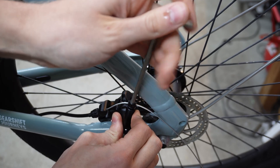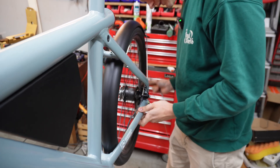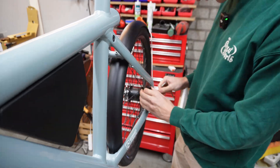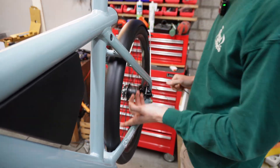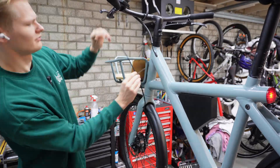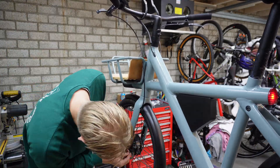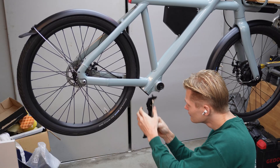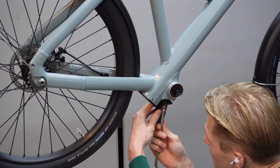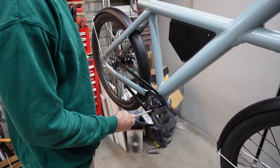With the inner cable wired up to the caliper I can start adjusting everything. These are mechanical brakes, so they're not that difficult to adjust — you just need to try it a couple of times and get the hang of it. These disc brakes are not the greatest in the world, but the bike is fairly lightweight so it's not too bad. They have enough power if you just stay on top of the maintenance. The front brake also needs to be wired up, adjusted, and connected, but that's just a repeat of the rear brake. I realized I didn't put copper grease on the kickstand bolt, and since I don't want it to get rusted stuck in the future, I'll fix that now. Then it was time to mount the chain guard, tensioner, and drivetrain — I think the chain glider design makes a lot of noise even when adjusted.